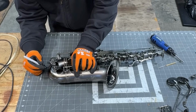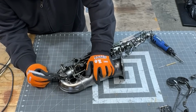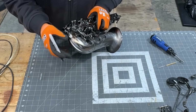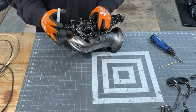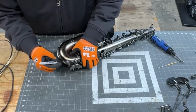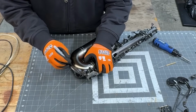And what that will do is it will not look like you drew on it with a Sharpie, but it's going to blend in that solder. So it's not going to jump out to the client or to anybody. And then by the time that little bit of Sharpie on the crack there wears away, the solder will have turned gray and really blend back in. I wish I could take credit for that, but some old timer along the way showed it to me. And now I'm showing it to you.